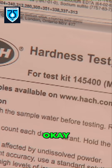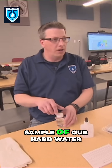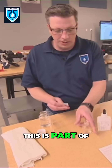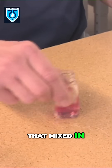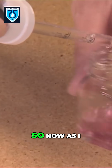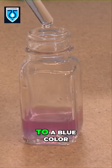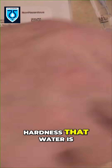Okay, let's walk through this test. I already collected a sample of our hard water. I have a hard indicator packet here — this is part of the chemical process that goes into it. Now that I have that mixed in, you can see the base color is a really bright pink. As I go and add my drops and count them, it's going to go from that pink color to a blue color, and the amount of drops is going to equal the amount of hardness that the water is.